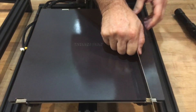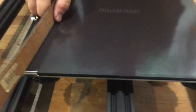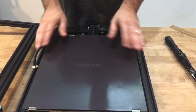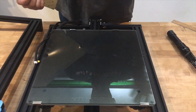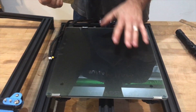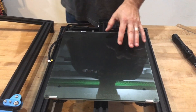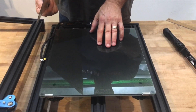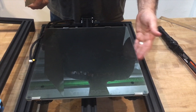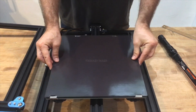I'll show how I cut out the magnet so it fits over the clips nicely. I can then lay a ruler across and be sure that the metal is not going to interfere with our flexi plate. I'm going to mount my magnetic sheet right to the glass plate and put it back on. I've altered the clips so I can keep them and still remove the glass plate with the magnet — for example, when changing machines or changing heated beds. The drawback is you've got to heat up the glass plate before heating the magnet and flexi plate, adding a layer of insulation and a little more heating time. I would prefer mounting directly to the aluminum bed, but you have to have a flat bed.